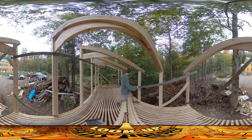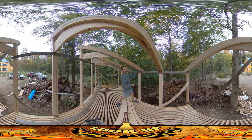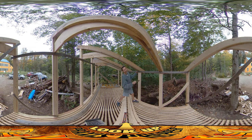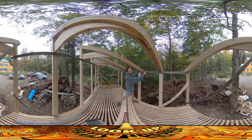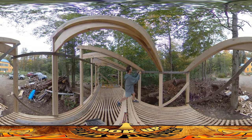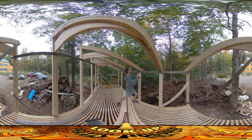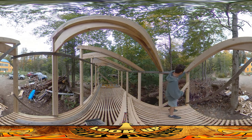I'm going to take this board and nail it to some random board in the middle, which is going to be this one here. I'm going to make sure it's not overshooting on the outside because I need to be able to put my boards on the outside. I'm going to make sure it's in a good position on that first post and nail it in here. This nail is going to be temporary because I don't know whether this thing's straight up and down or not — I know this one is, so I'm going to nail it in over here.